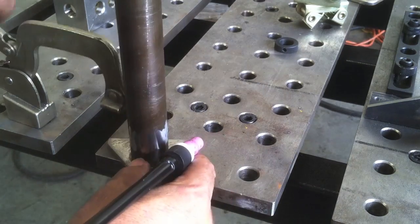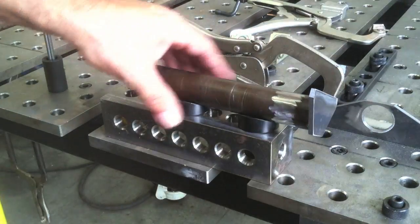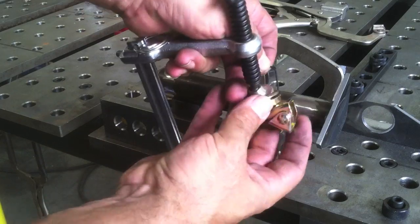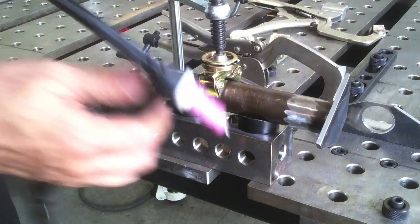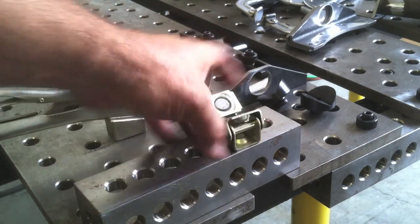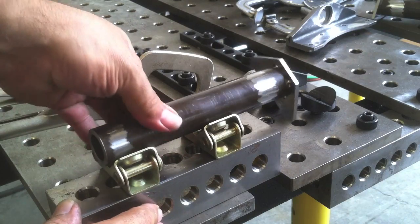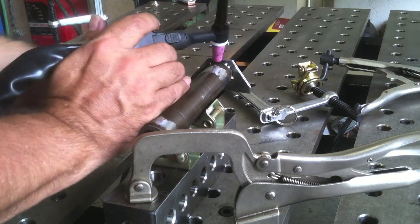That piece has to be welded all the way around and you can't get access to it all one way. Here's one way — just clamping it and spinning it. I want to show you the versatility of this table and tooling package. Another option is setting up a little welding turntable station like this. A lot of the clamps have the option of attaching a v-pad to the swivel foot — see how easy that is, just a little spring clip that locks in. Or I can use these magnetic v-pads, which is even quicker and I don't have to loosen the clamp every time I turn around. That makes a kind of makeshift little turntable for spinning round parts — and that's pretty much the way I settled on welding these little plates on the end of these tubes.